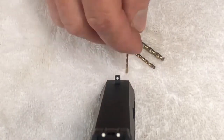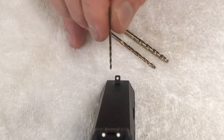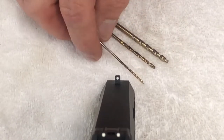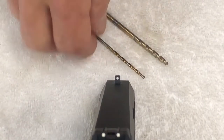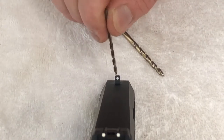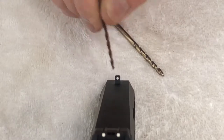Whether your sight is polymer or metal, if it's completely flat with no indentation on it, start with the smallest drill bit you could find. You're going to have to center it and make a small indentation with it as your starting point. If spinning by hand or in a rotary tool and starting with the smallest bit, just touch lightly the previous indentation you made, checking numerous times that you are forming the dimple or cup where you intended to. Once satisfied that you are centered, move to the next larger sized bit, again touching with just enough pressure to begin removing material and checking numerous times that you are creating a centered and even dimple.